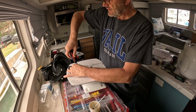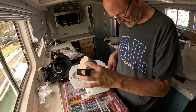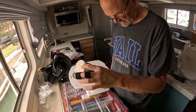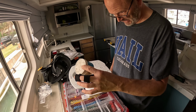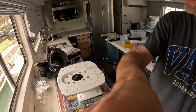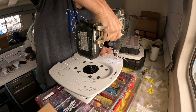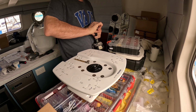Look at their casting release. So there's that. Ultra Tef Gel. What's it say? The corrosion eliminator and anti-seize lubricant. Apply and assemble. It eliminates pitting, galling. That's what happened. I think that one galled on me. And corrosion. Use that. Seems to work really well. That looks good. Okay, so I'd say that piece is ready. I'm going to drill this out now. Okay, let's jump up to 15/64.